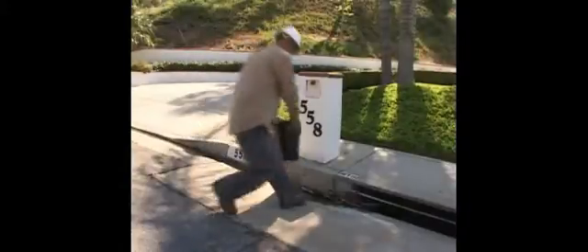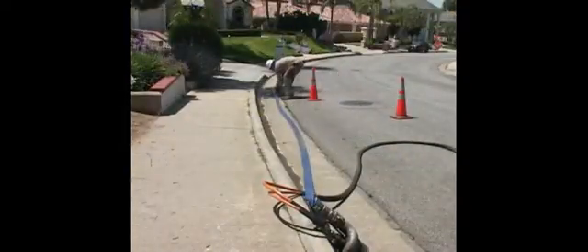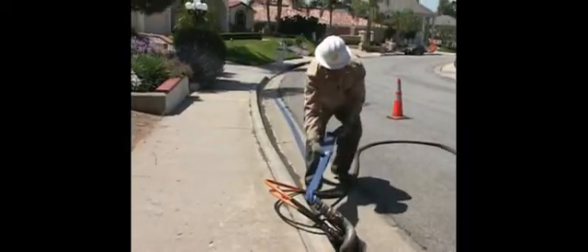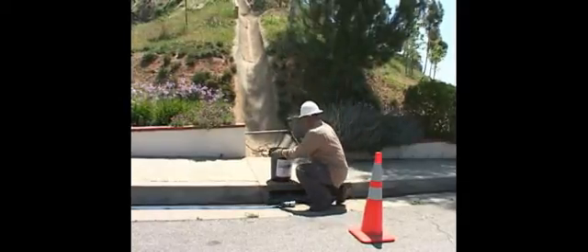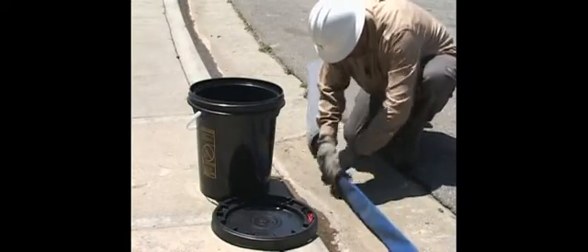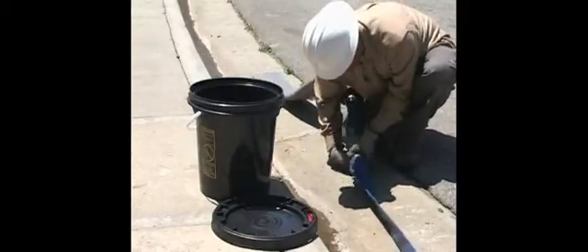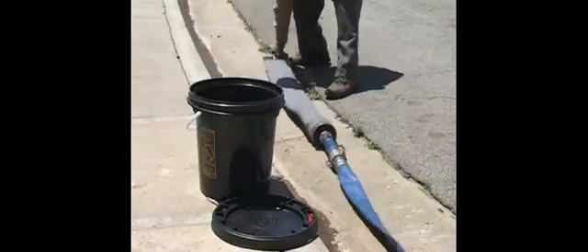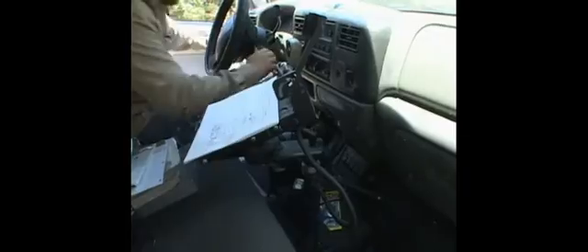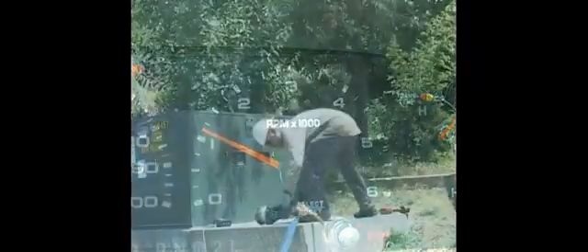Clean the gutter of debris so water will flow unimpeded into the storm drain. Unroll the hose towards the downgrade, close to the storm drain. Inspect the pump hose thoroughly, checking for any cracks, rips, or holes where contaminated water could leak out. To use the filter sock, remove it from the plastic pail and attach it to the end of the hose coming out of the electric or hydraulic pump. If the hose doesn't fit the 2-inch sock, use an adapter to secure the sock tightly before pumping begins. The truck should be on idle to control the flow of water, pumping at a rate of 100 to 150 gallons per minute. The system can become over-pressurized if the truck does not run at idle engine speed.